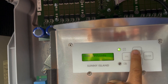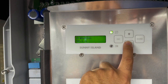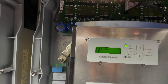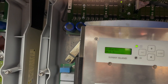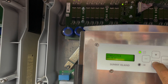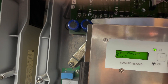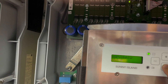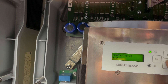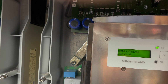We're going to go to meters, battery meters. It's about 5% off on this Sunny Island, and the reason is it's important to get the full charge in — that's what allows it to know where it is on the state of charge. So that's what I'm doing every seven days now, and I haven't hit seven days yet so it hasn't done a full charge. It's in float right now. 54.2 is what I have as a float voltage. You can see it says float, there's a current, and a temperature. I can see I'm in a terrible state of error and I think it's because I've never gotten a full charge in on it yet.